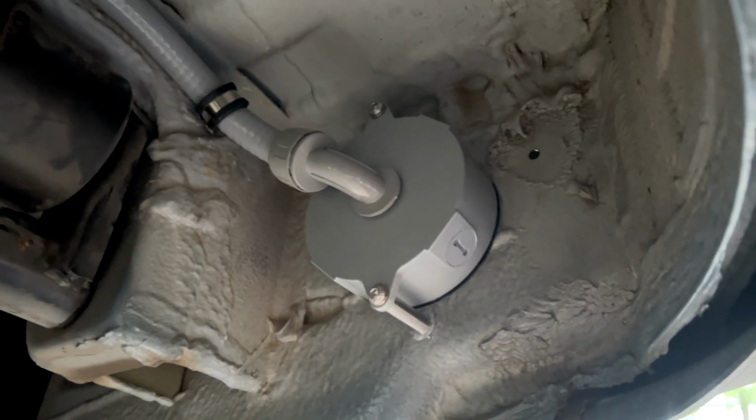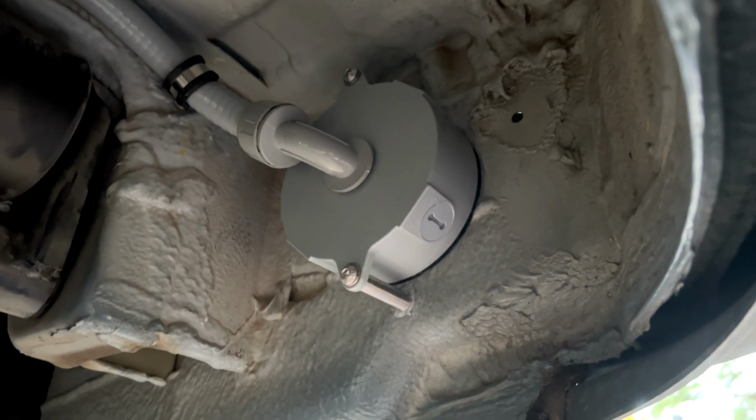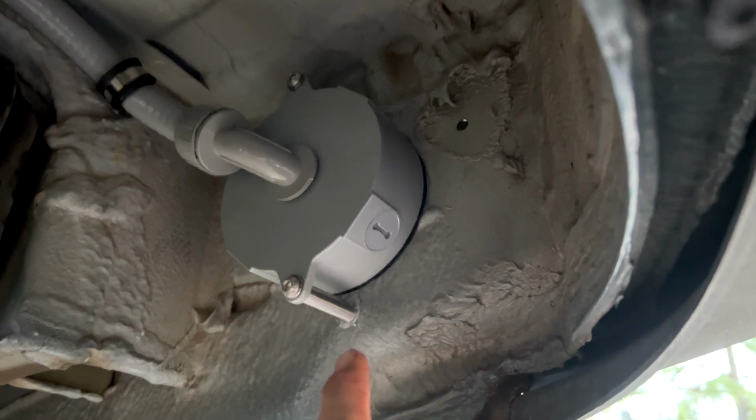Here's that box all mounted up to the inside with the liquid-tight cord grip all snugged up. I made a few standoffs so I didn't have super long screws and also thought it was a cleaner look anyways. I also put silicone sealant around the outside and where the standoffs hit the van.